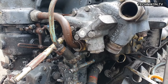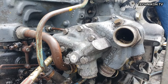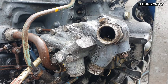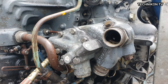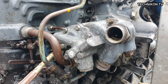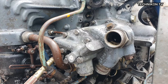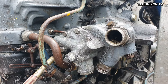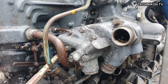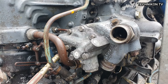As you can see, the casing is a bit corroded. We're going to remove it as we're stripping everything we can strip, and these will be discarded straight away. There's no way we're going to treat this corrosion — we're going to strip the pump and look inside. If it's only the casing which is affected, we shall just discard the casing and get a new one.